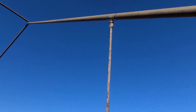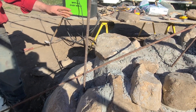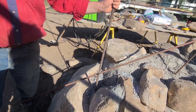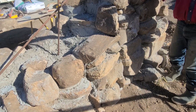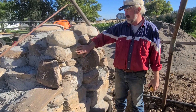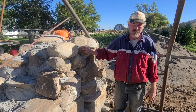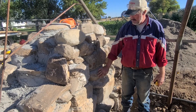The rebar goes all the way up — it's just normal reinforcement, part of the concrete. It's already in this wall; there are several pieces in that stonework. We're just setting up the stone wall in a rustic style, using normal stones we're picking up right here on site. And we're putting the mortar together from components we bought — we're not buying premade mortar, that's too expensive. Just mixing it up and setting the stones.